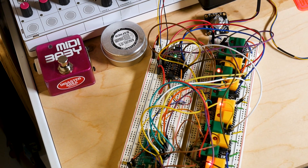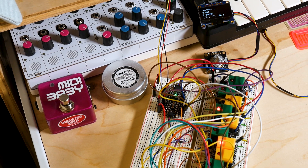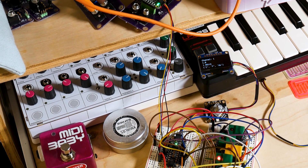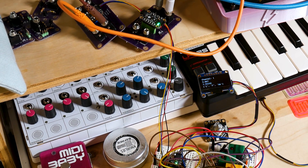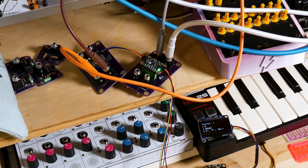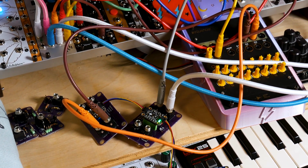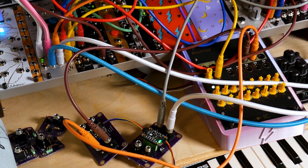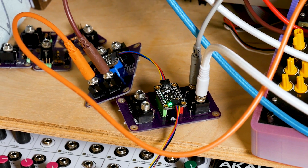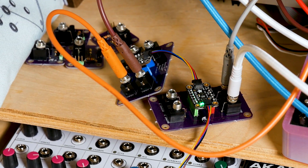That seemed to help with the pitch stability, but it was still pitchy. The MCP4728 DAC is a 12-bit DAC, meaning it doesn't have the best resolution. The output is not going to be exactly what you're expecting because there's quantization happening in the DAC - which is funny because this project is a quantizer. So it's like quantizing the quantization, and as a result the pitch sounds pitchy. I'm especially noticing that E naturals are sounding a bit sharp, which is annoying.